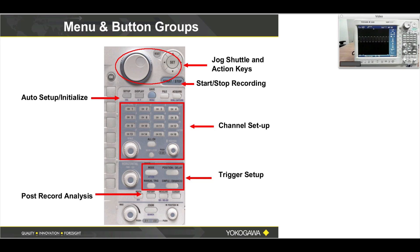We have a modern interface much like the Apple iPod — a set button, up, left, down, and right arrows. If you're not used to an iPod, these take a little time. I'm old school — I used Tektronix and Agilent scopes before Yokogawa, and everything had a knob. Instruments have moved to soft menus, and the shuttle and jog knobs here work very well — please get acquainted with those. The most important button on the front is start/stop. Occasionally if you see an error message you need to hit stop, as some adjustments cannot be made while the scope is running.